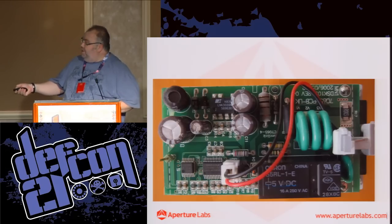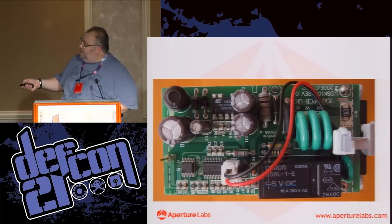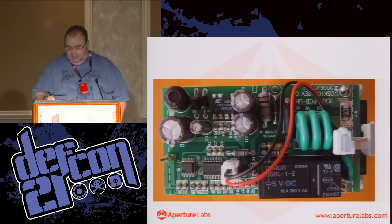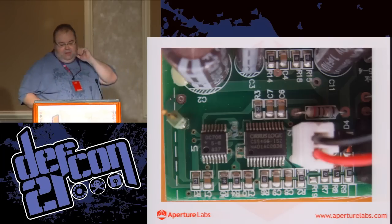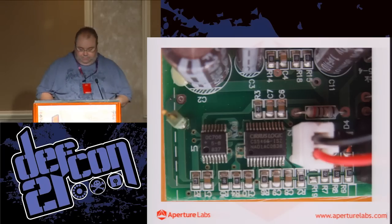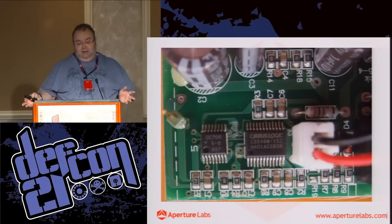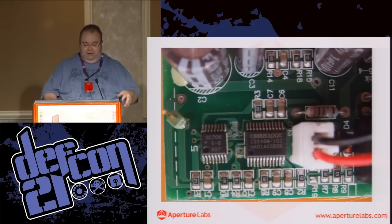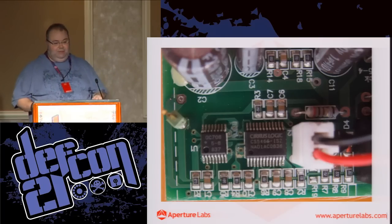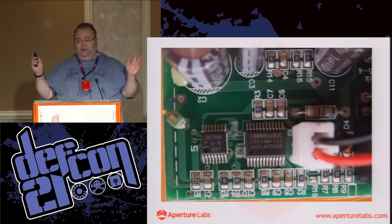On the top here, you have a little power supply. The next important thing is this resistor here, resistor 17, which is to measure the current. So here are the actual important bits. We have two chips here. A Cirrus Logic chip, which is nice and clearly marked. Cirrus Logic is the vendor. It's a CS5466-ISZ. Type that into Google and you'll get the data sheet and you're off.